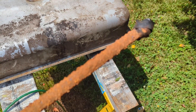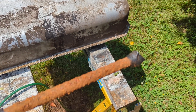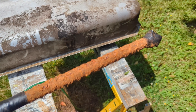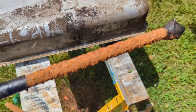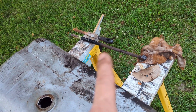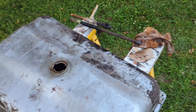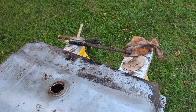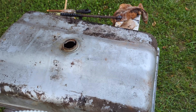You can see all the rust collecting on the electrode. I'll just file this off, clean it up, and stick it back in and hook the charger back up. The first time I stuck it in there I had the positive and negative reversed, and it came out as clean as it ever has because all the rust on the rod actually transferred to the tank. So I'm headed in the right direction this time. Back on this gas tank — I just want to give you a sense of what was actually coming out of this thing. It's pulling a lot more away from the tank than going to the rod. I just basically turned it over and dumped it into a bucket so all the solids would settle to the bottom, then I could rinse it out and start over.